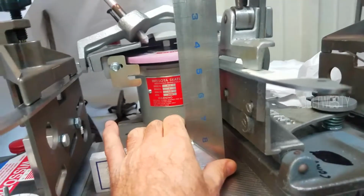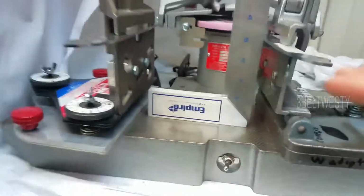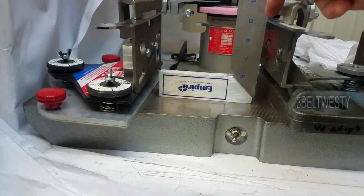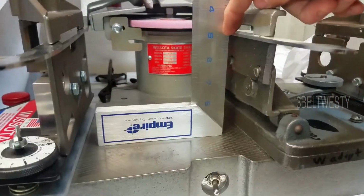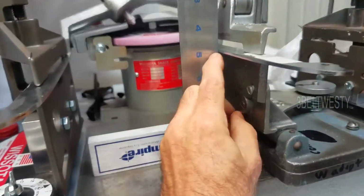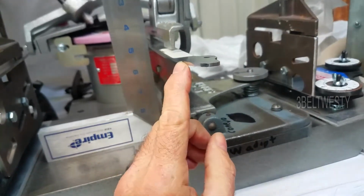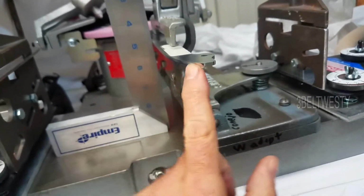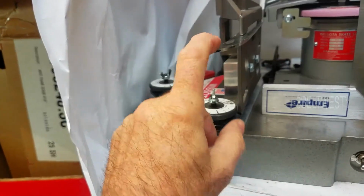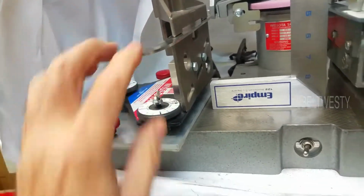Now the downside of this type of adjustment is that you're actually tilting the blade up like this a little bit or down. So along the skate wheel here, when you grind, if you had it perfectly where the edge heights are perfect here when you hit the wheel, you're going to get a small error when you get down to here because this is pitched up or pitched down. And that's on any type of machine, Wissota, Blackstone, Easy Sharp, Ford, General Motors, whatever.